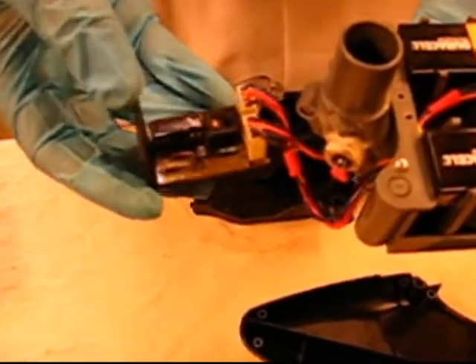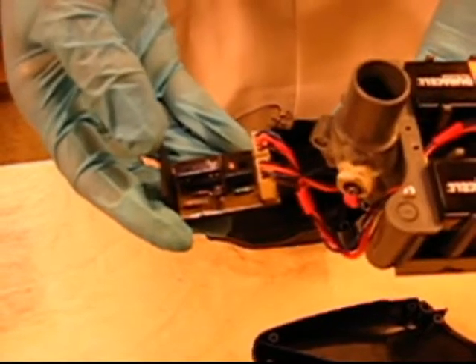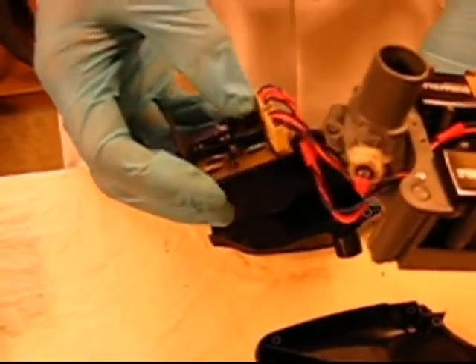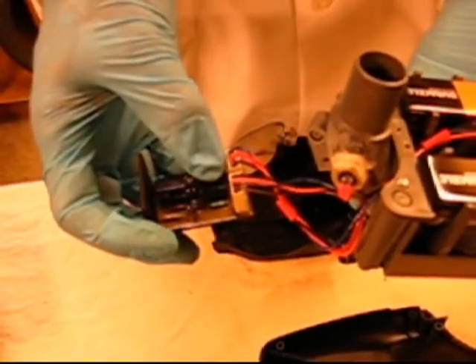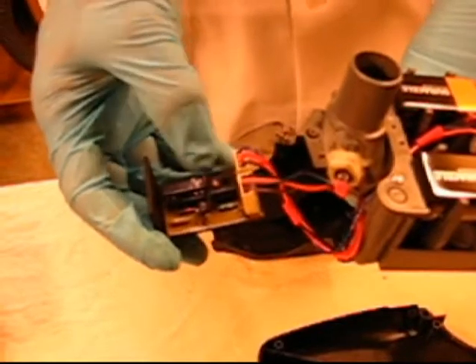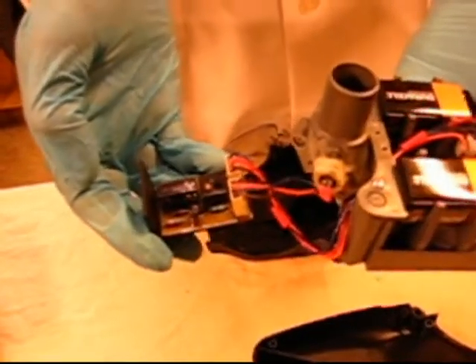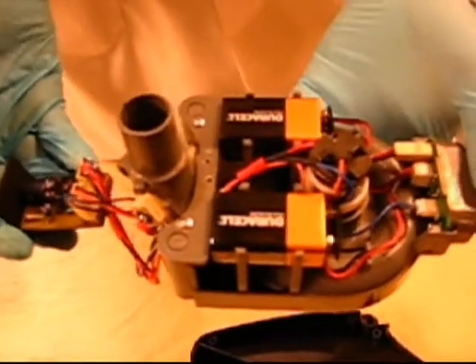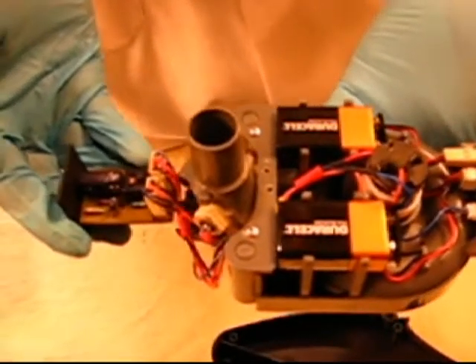Best of all, the system is designed as an interrupt rather than a replacement. These are the eyes here in the feed neck — system on, system off. If for any reason an eye or relay should fail, all you have to do is open up your hopper, flip a switch, and you can revert back to the normal operation of the torque hopper and remove this system entirely. Completely fail proof.